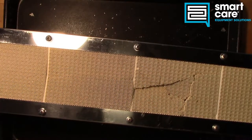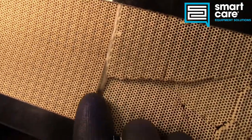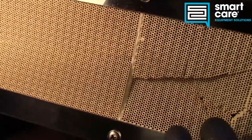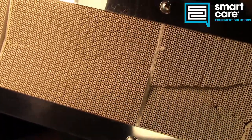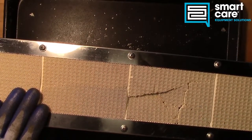You can also see in between the tiles there's some gasketing material. You have to pay very close attention to that gasketing material whenever you're working with these. You want to make sure these burners are not cracked and that the gasketing material is still in place and not pushed out or gone. So with all that said, let's go ahead and take it apart and take a look at what's inside.